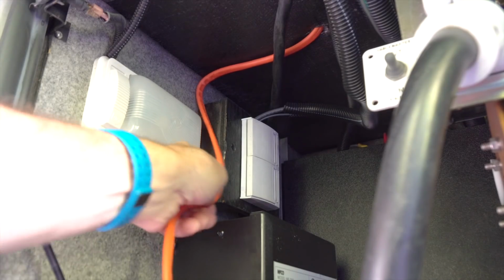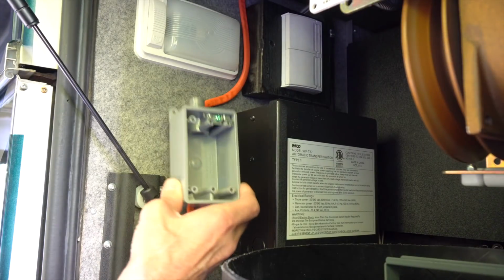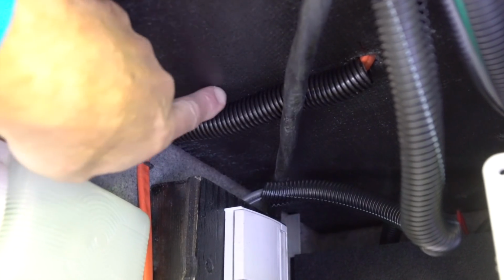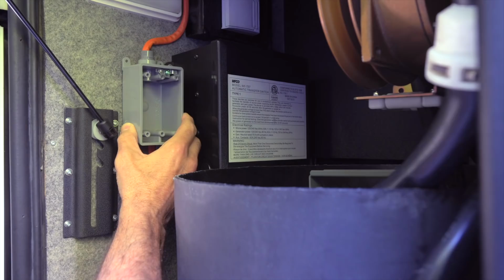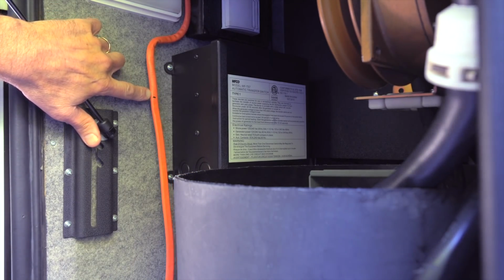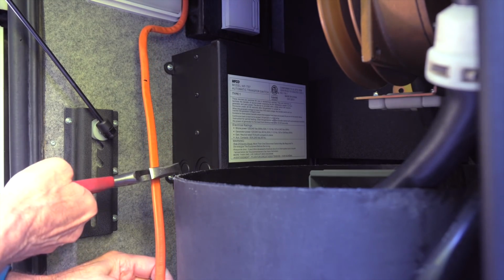In the electrical compartment, we've routed our cable down the wall to where the box will be mounted here alongside our transfer switch. We used a hammer staple to secure the cable into the wall and added a piece of split loom on the upper section so that it blends in more with the other wiring up there. Again, we've marked where our Romex will come into the box. We'll want about 6 inches of wiring available, so we'll cut off the excess.